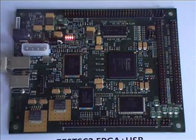The FPGA clocks are fixed at 48 MHz for the streaming interface between USB and FPGA, and for the microcontroller registers interface between USB and FPGA. To provide an out-of-the-box experience, the ZestSC2 is supplied with a host library and drivers for configuring the FPGA and communicating with the FPGA that run on Windows and Linux.